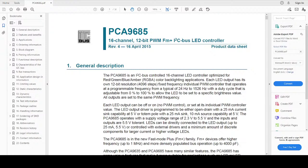Now, the people over at Adafruit, probably Lady Ada herself, had a look at this chip and thought, you know, it's got a big range in its PWM, but we can probably use a small portion of that and drive a servo. If you run this at, say, 50 hertz or 60 hertz or something like that, which is still within the range of the servo, you can take that 4096 different possible ranges and work out where 1 millisecond starts, or maybe we go a little bit wider, maybe 500 microseconds, and then where 2500 microseconds finishes, and that's the range that the servo wants a pulse in.